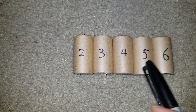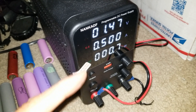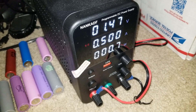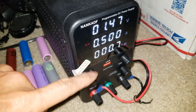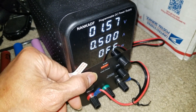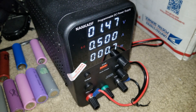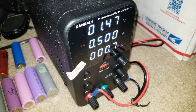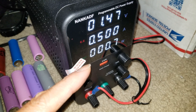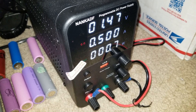Normally this battery would be like 1.25 or 1.2 volts. We are going to charge it up to like 1.57 volts. It shows 1.57 — that's what I set it to, and it's trying to charge up to 1.57 volts. Once you bring up the voltage, you could try to put it on your charging station and allow it to charge.